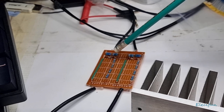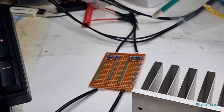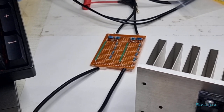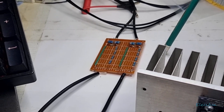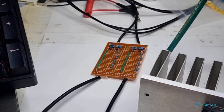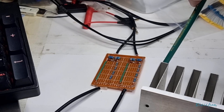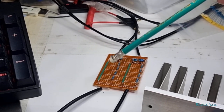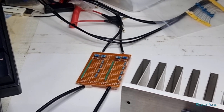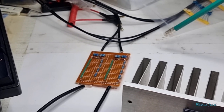And there's also a diode clamp there, so I can't exceed the maximum input of the line in on my onboard sound card. The reason I've set this up like this is because my onboard sound card is just what comes with the main board of my PC. The majority of you have got computers and you're interested in this sort of thing, so you can set one of these up for yourself to be a voltage probe. You could be doing your own type of measurements with this sort of stuff. So this is why I've done it this time with my own sound card on the machine.